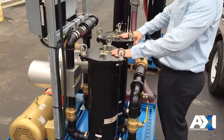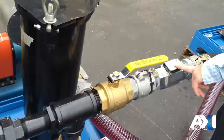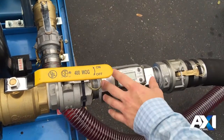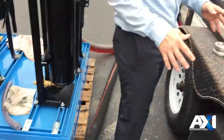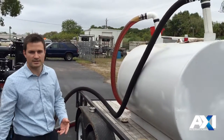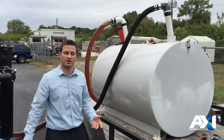After the final filter stage, we move out of the skid and you can view the flow rate on an optional flow rate meter. This will give you an idea of what you're putting in and out of the tank as we move through the discharge hose back into the tank. This process can run for a number of hours depending on how big the tank is, what your fuel quality is, and where you want to be with the fuel quality at the end of the day.